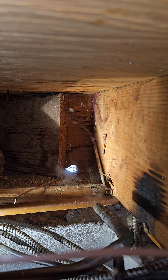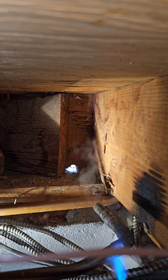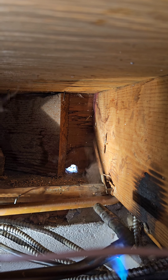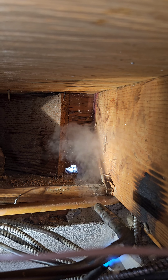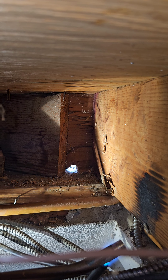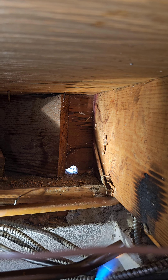I apply some heat - you can see some steam coming out because there's water in the pipe. Heat it up enough until the water starts steaming out. Once there's no water in the pipe, you're going to start seeing the solder get soft and start splattering. That's when you grab your channel locks and start moving the fitting or pipe you're removing. I keep applying heat until it's ready, then grab the channels and slowly tug it - little by little - and once it's ready it'll pop out easily.